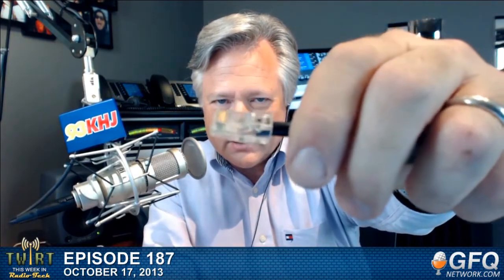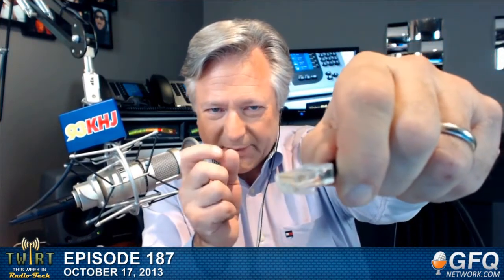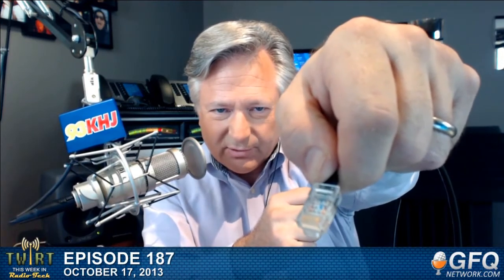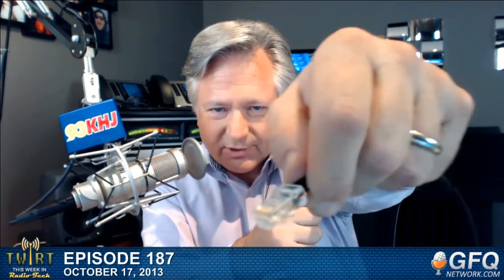I have crimped the jacket. The clamp there has come down on the jacket, so the jacket is being held in there, captivated. And when I crimped it, little blades on each of the eight copper contacts went into the insulation of the eight individual conductors. Now we can take the hood and put it on there, and we have a snag-free cable that we could pull backwards through a mess of wires, and it would not snag. It's snagless. So what do you think? Do we do good? Looks good.